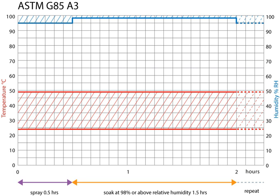Test specimens are placed in an enclosed chamber and exposed to a changing climate comprising a three-part repeating cycle: 0.75 hours exposure to a continuous indirect spray of salt water solution acidified to pH 2.8 to 3.0 by the addition of acetic acid, falling at a rate of 1.0 to 2.0 milliliters per 80 square centimeters per hour; followed by 2.0 hours of air drying; followed by 3.25 hours of high humidity gradually rising to between 65% RH and 95% RH. The entire cycle is at a constant chamber temperature of +49°C.